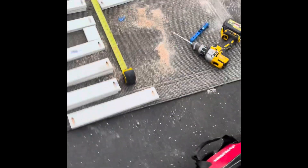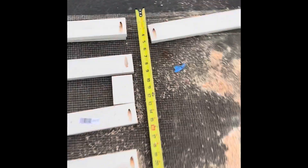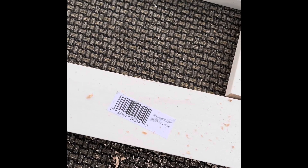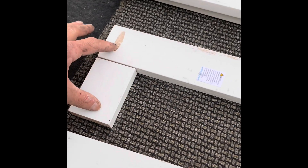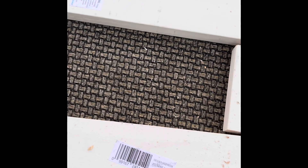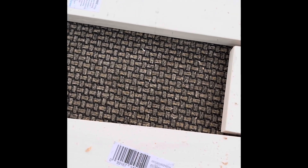One is when I go to run the router to inlay my plywood, regarding the number of fasteners — I was trying to use two or three fasteners — now I'm going to try to use one fastener and wood glue so that my router doesn't touch those spots, because I was running into that problem.